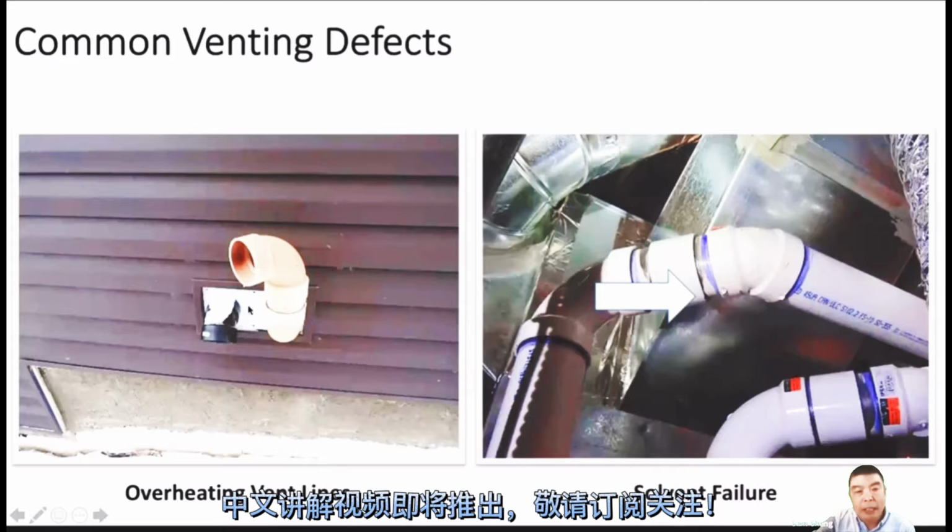Around there. Some furnaces may give you a range, for example 3.2 to 3.8 inch. If the pressure is in the middle of this range, it should be okay. But if it's too high, that will cause trouble. A problem like the secondary heat exchanger is blocked.